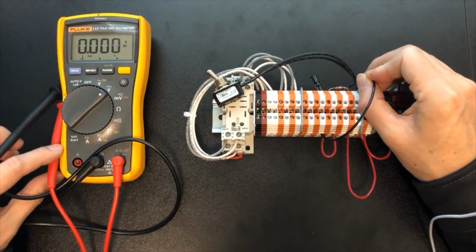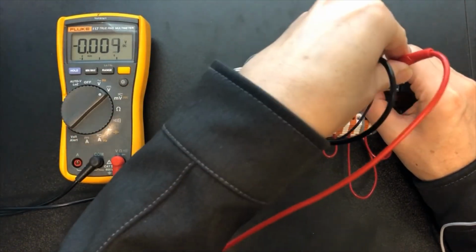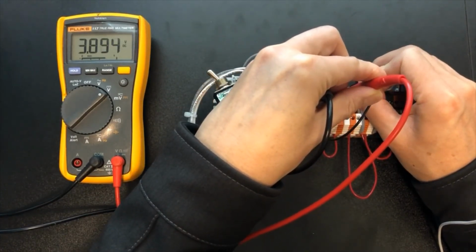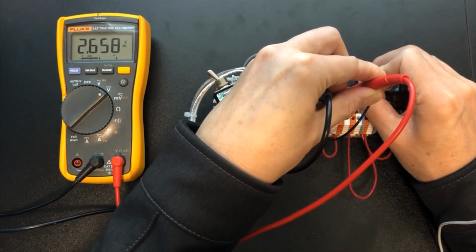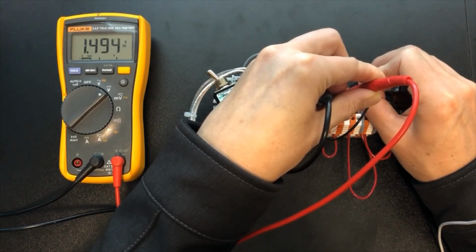And the capacitor now is being discharged. And you can measure the voltage across the capacitor. Well, this may be very tricky to do. You can see the voltage dropping, right? You keep discharging the capacitor until the voltage is very close to 0, and the capacitor is ready for being charged again.